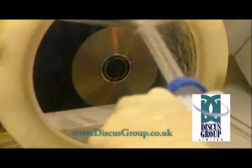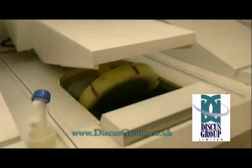The information is now engraved on the disc. The disc is placed in a galvanic bath to apply a thin coating of nickel and vanadium by electrolysis.